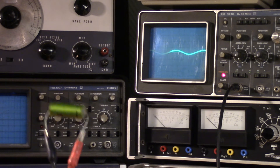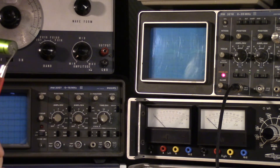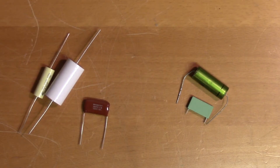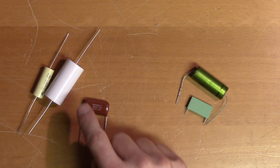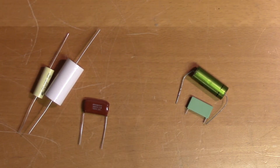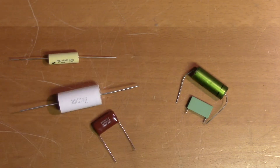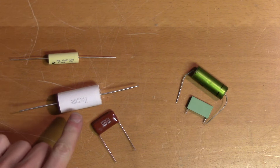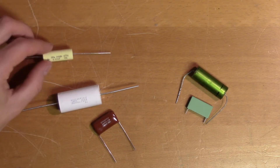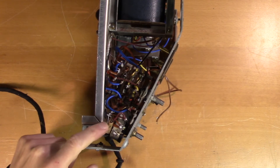So as we can see, this is not at all as affected by where on the capacitor I'm placing my fingers as the previous one was. That strongly indicates that there is one solid sheet of outer shielding on this capacitor, while the other ones seem to have multiple sections. So the lesson here would be that you shouldn't go for a higher voltage rating than necessary, because that could actually lead to worse performance. That is a pretty good lesson — something I did not know. For this capacitor replacement I did not exceed the specified voltage ratings, except if I couldn't find a direct match.